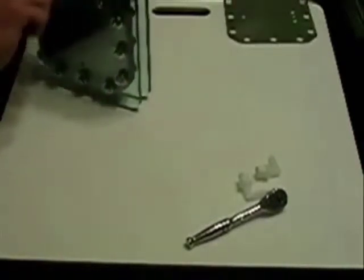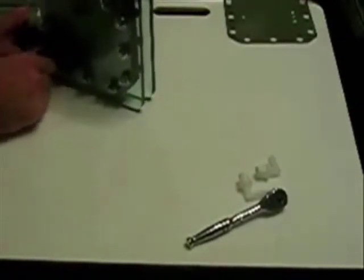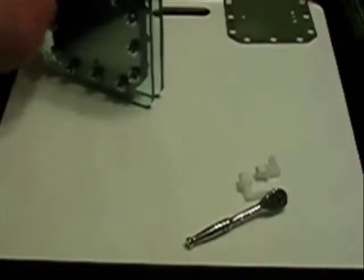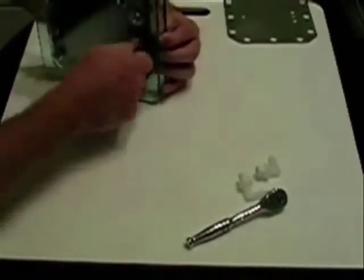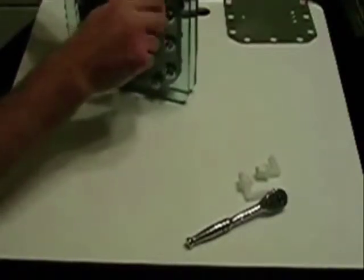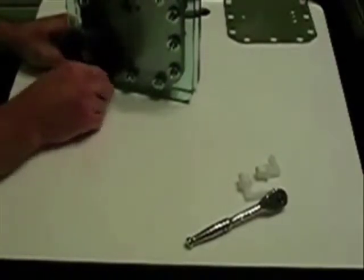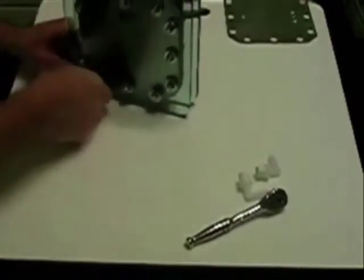When you're putting these on, I'm just doing it hand tight right now. But when you go to torque these, make sure you do it in a star pattern, like you would when changing a tire or putting a wheel back on a car. That ensures you're getting even pressure all the way around. You don't ever want to over-tighten this material — or any gasket material — as you're liable to damage the gasket. Believe me, that's no fun when you've filled these things up with electrolyte and have to go back and tear it apart to repair a small problem with the gasket.